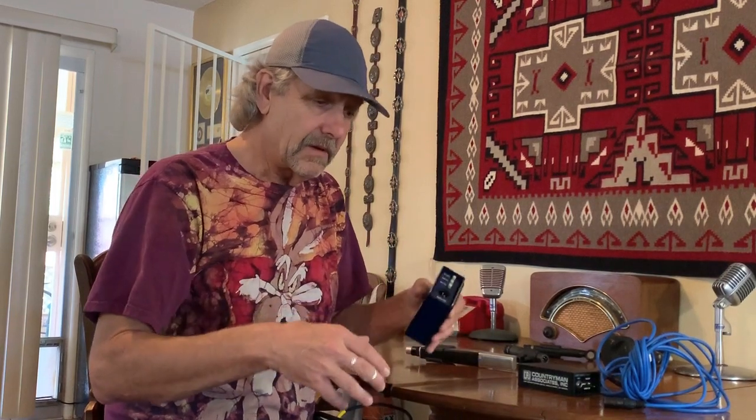You might be thinking: why not just plug the bass guitar into a bass amp and mic it, or plug the keyboard into an amplifier and put a microphone in front of it? That's a great way to record either of those instruments. However, a lot of times when recording bass or keys you're doing basic tracks or rhythm tracks, which means the drums are involved. If you want the keyboard player or bass player in the same room as the drummer whose drums are mic'd, the direct box is the right solution — the bass or keyboard goes directly into the box and into the mic input panel without making a sound in the room with the drums.